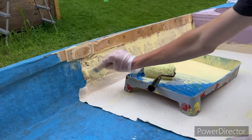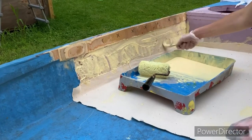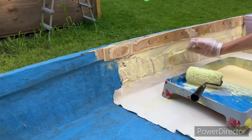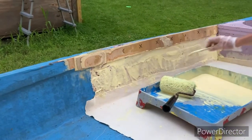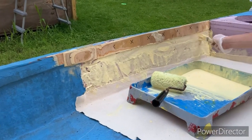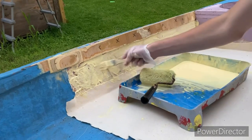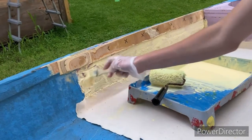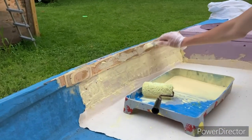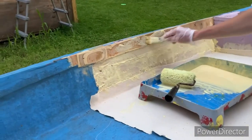And the glue is also the way to go for attaching the fabric to wood, which this is plywood rails. You want to make sure you paint the edges of your plywood really well with the glue. It will wick into the plywood and help preserve it so it won't delaminate. We use Patriot Timbers Sure Ply, which is an interior Luon, but it actually has a glue that is waterproof, unlike most of the Luon underlayment stuff you're going to find.